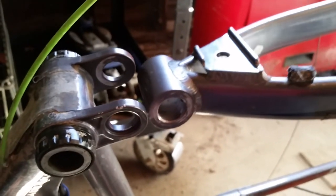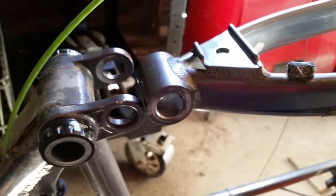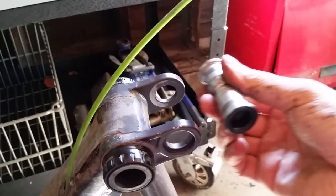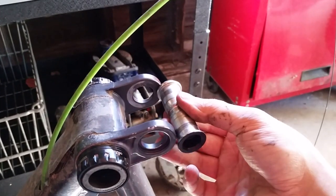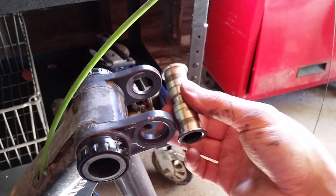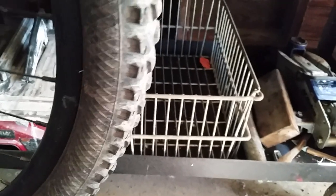What I was noticing was that the plastic babbitt bearings are slightly worn, and this was causing a little bit of side-to-side play because the hole is kind of bored out a little bit. If you look here, this is what it rides on — it's just metal on plastic.